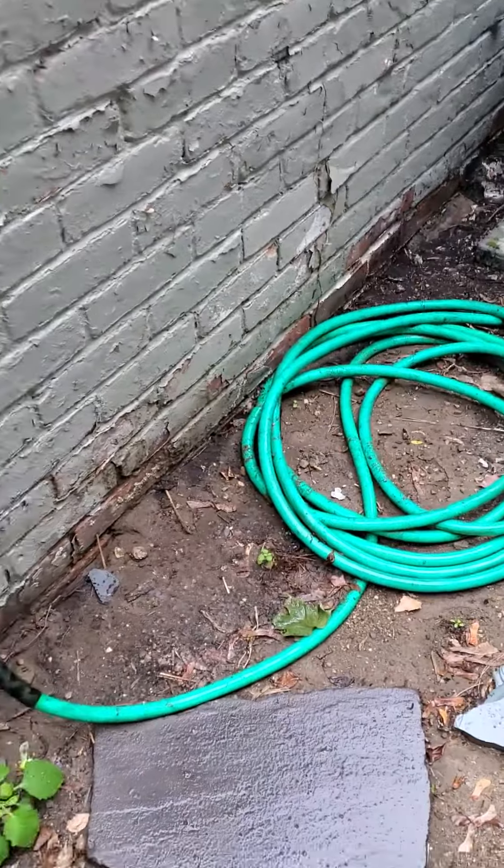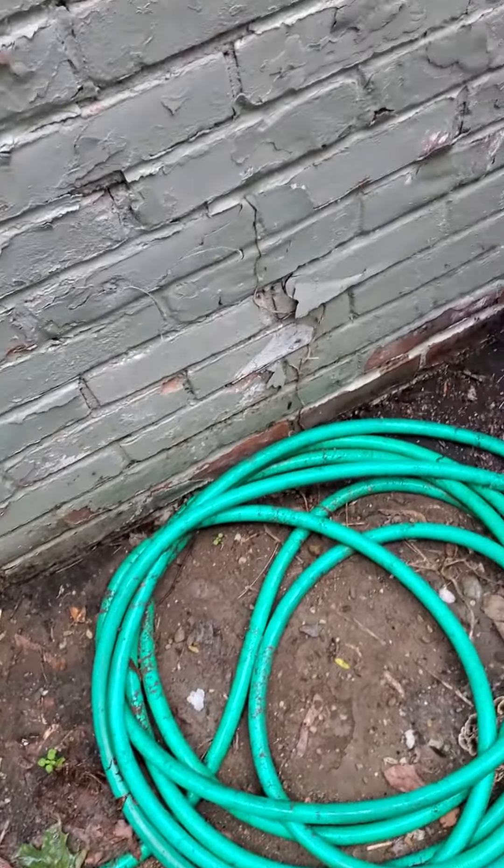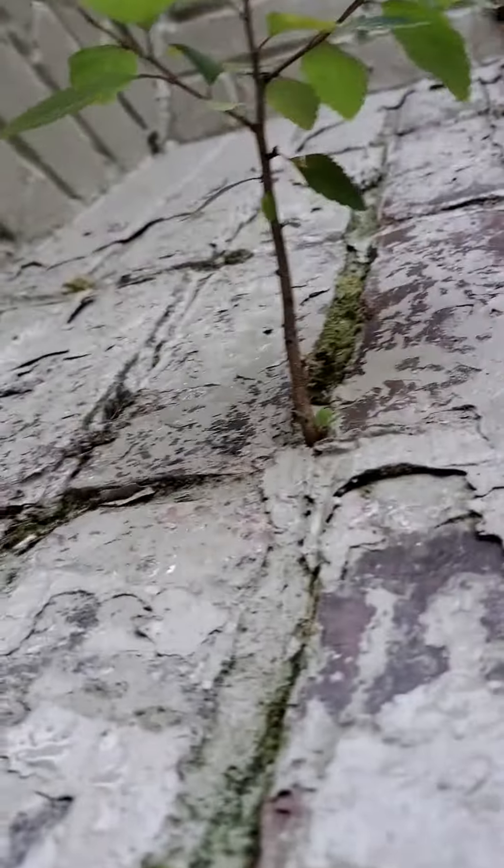Why did I do that? Because you don't want to spend money and dig up below ground if all the water is only entering through above-ground openings. See that one? Some people only need tuck pointing and flashing, etc., up there.